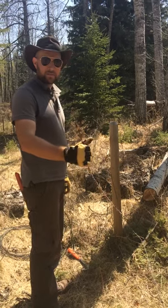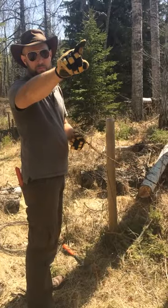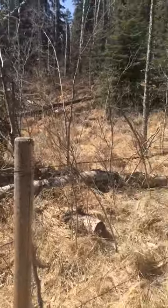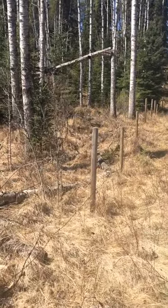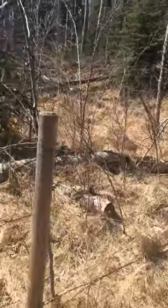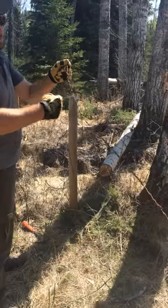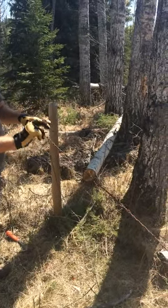This is how to use the hammer to tighten the wire. There's a break in the wire here. We've gone through and loosened all the staples so that the wire can pull through quite happily without getting barbs caught in the staples. At the end of the wire, we've just folded it back on itself with plenty of room and wound it at least three times — sometimes more, especially if it's old wire.